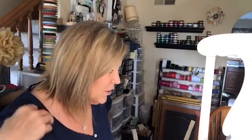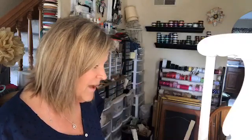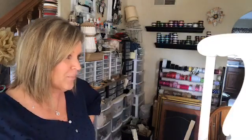I think I'm gonna go with, I don't know which one. The shellac looks really good, except I'm painting this thing white and I don't really want to have an extra coat because I've shellacked it. So I think I'm gonna go with the oil primer, and I'm just gonna hit the spots that are bleeding. And that's how I do it.